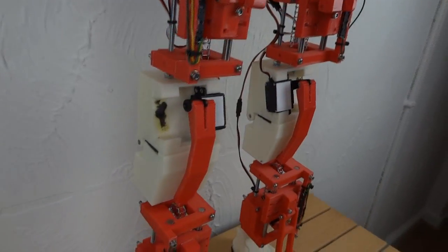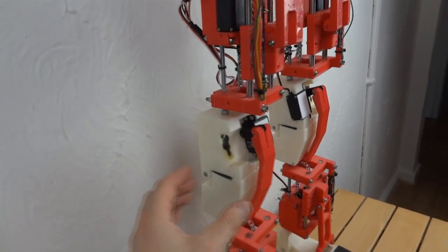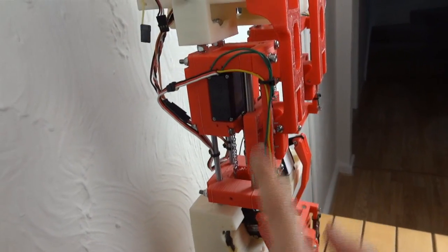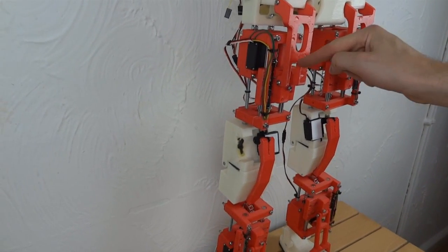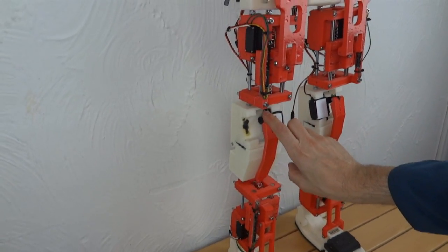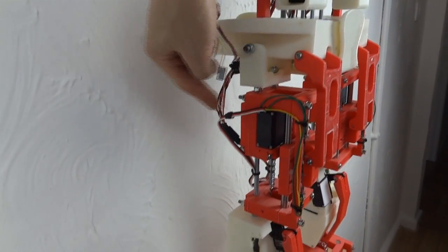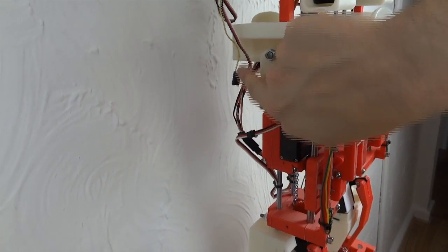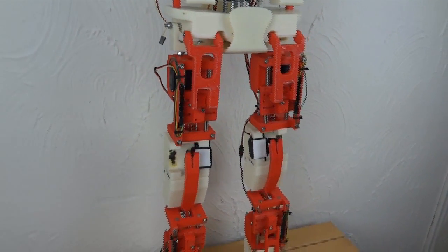All that really is left is the old knees, which look a bit strange. In profile they're kind of set back, because all the old parts were set centrally down this rod and the new actuators are on the front. What I'd really like to do is replace those and use these actuators with a lever to push the knee joint, and possibly shorten the knee as well, because the legs are getting quite long. Then put another actuator on the back, fitting them back to back, to actuate the thigh with a lever. But for now I think the knees are going to be fine to make it work, so I'm going to leave them as they are.